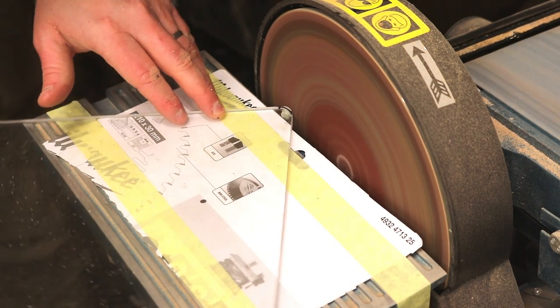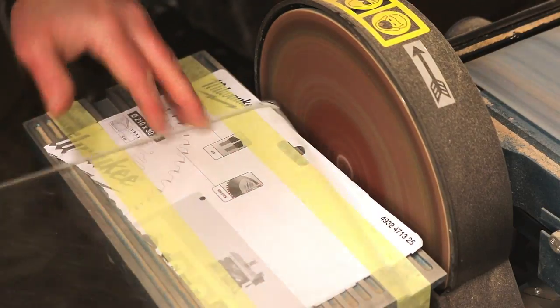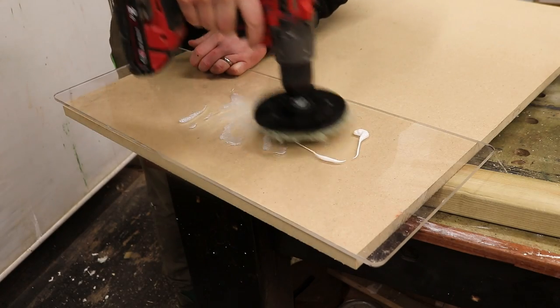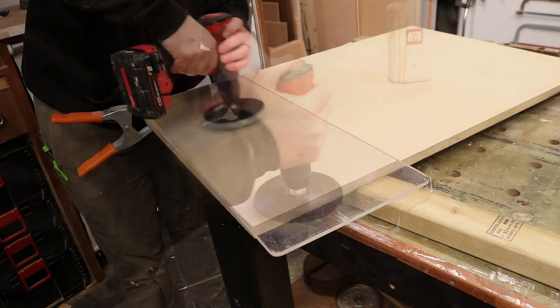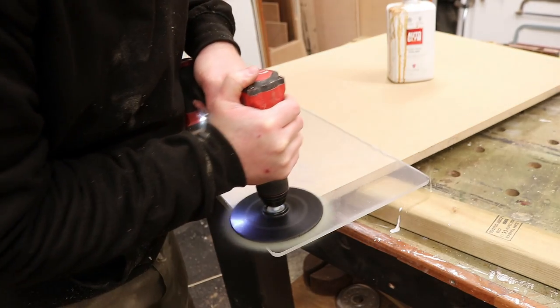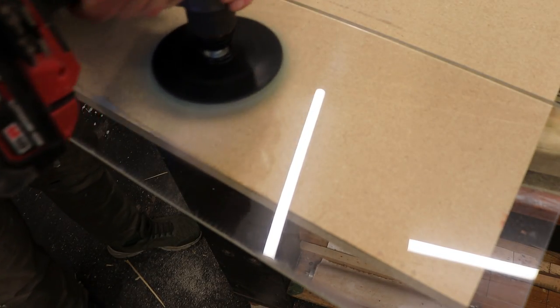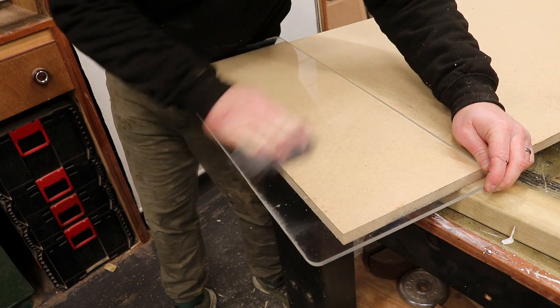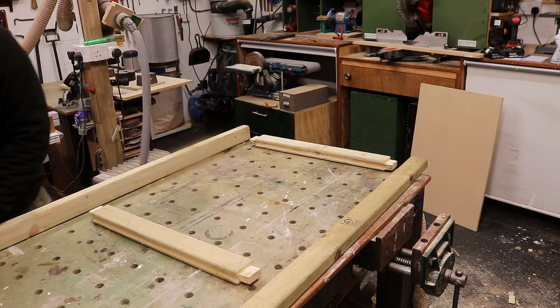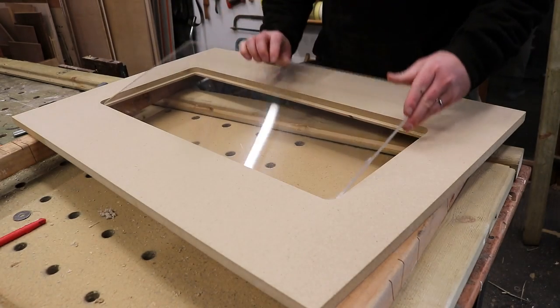I added a bit of cardboard just to protect it from the metal table. So I mentioned this plexiglass was salvaged and as you can see there are quite a few scratches and scuffs on it, so I'm going to attempt to clean it up using some liquid cutting compound which I had in a cupboard. I think this is usually used for car bodywork but it should help to cut through some of the damage, and I'm using a buffing pad in the drill to apply it. This was never going to turn out perfect but it certainly made a big difference. And then I can buff it clean with a cotton cloth. After doing some final sanding I can test the fit of the plexiglass and it looked perfect.